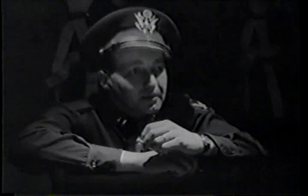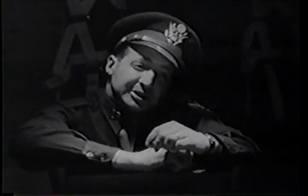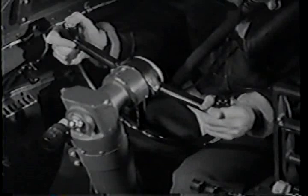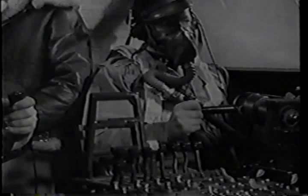Sure, Anderson. Oil smoke is usually sort of gray, and smoke from gas is generally black. But personally, I won't be taking time to examine it, even if I can see it that clearly. I'd rather shut everything off that might be feeding that fire and ask questions afterwards. My co-pilot increases airspeed to try to blow the fire out, diving the plane, or if altitude is low, increasing power on the three good engines. Meanwhile, I get the cowl flaps open on the engine that's on fire to help cool things off in there. Then, lock the cowl flaps so if the hydraulic line's broken, the fluid won't keep feeding the fire.